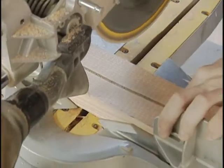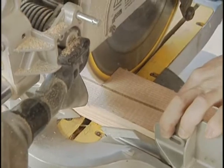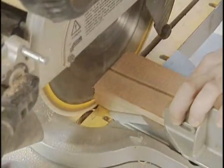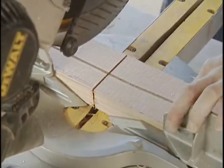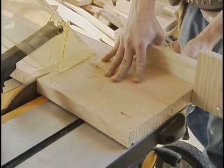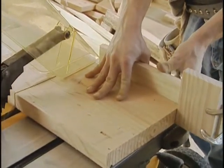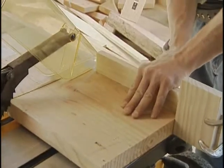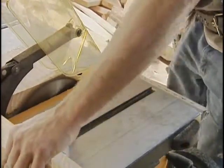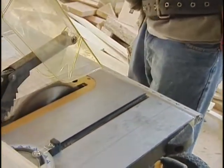A simple adjustment described in the owner's manual will bring the saw into alignment. Despite its accuracy, the miter saw has one major drawback: width of cut. A 10-inch saw can cut boards up to 6 inches wide; a 12-inch saw can cut boards up to 8 inches wide. For cross-cutting wider boards, you'll want a table saw. When you cross-cut on the table saw, you guide the cut with a miter gauge. You can buy an aftermarket gauge accurate to the thousandths of an inch and to within one-tenth of a degree, but you can also use the gauge that comes with the saw with pretty much the same results.